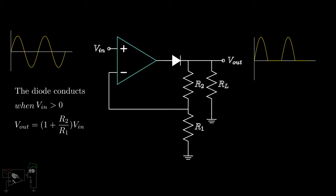Therefore, we somehow need to stop the op-amp output from going to minus Vsat. This issue can be solved by using another diode, which will be placed in the feedback loop. Now, whenever D2 is reverse-biased, D1 is forward-biased, thus maintaining the negative feedback. Therefore, Vx settles to a voltage very close to ground. Now when Vn becomes positive, the op-amp output quickly goes to some positive value. Hence, this circuit is known as the fast-precision half-wave rectifier.